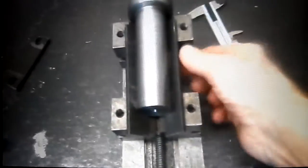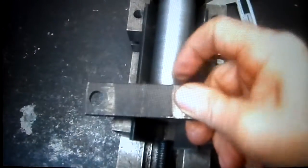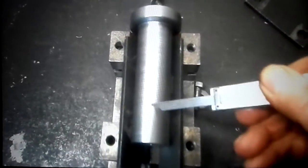These 2 pieces will be raising the job up so as they will not interfere with the milling cutter cutting the slot on the V's. It will be bolted across and bolted down to the milling table, which will keep it tight. But it has to be marked off, drilled for the milling cutter. This is a job I haven't tried before, raising it up on the V-blocks, but hopefully it should work out alright.